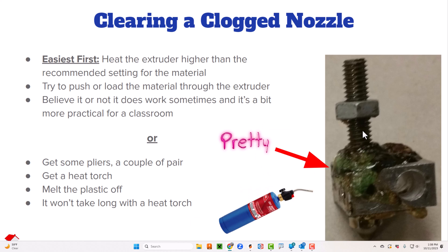An important thing is those have to be tightened under heat — this thing has to be heated up pretty well. You really want to grind that throat and the top part of the nozzle together; they should be very, very tight.